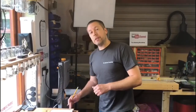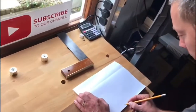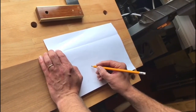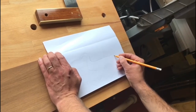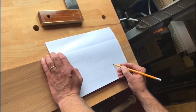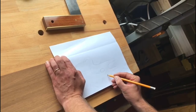Right, we're over to the drawing of it. I'm a bit of a Christmas person if I'm being honest, so I thought the chair would look a wee bit more like Santa's sleigh than anything else — so not an artist, just roughly. We'll start with the bottom, the rocking bit itself. Bring ourselves up and round, come in and up, and then a nice bend at the top, back around. You don't want to give yourself too many sharp straight lines because once this goes through the bandsaw it's a bit easier to have stronger curves, and of course through the sanding machine as well. We'll go with two circles, one here and one here.